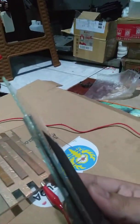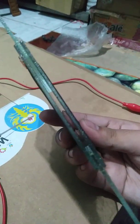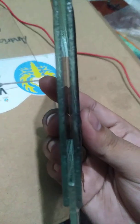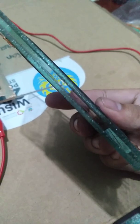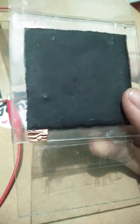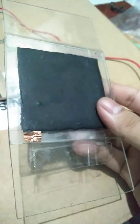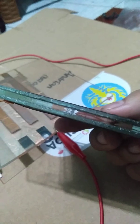My new electrode is coated on the surface of a glass. This is our adaptation of the double dielectric discharge system. It is called double dielectric because the dielectric is doubled — there are two glasses on the upper side and the bottom side, and both sides are coated with conductive carbon. Each electrode is separated and not connected, so the plasma will occur in the gap between the two dielectrics.